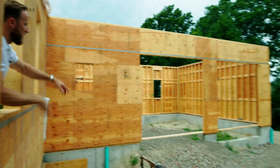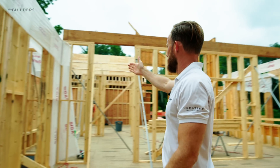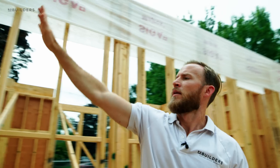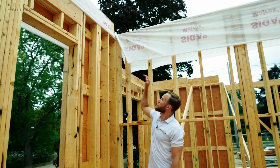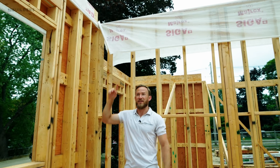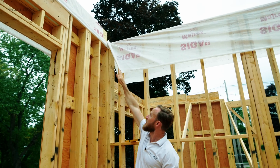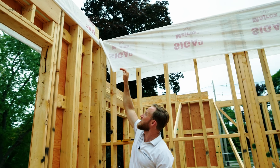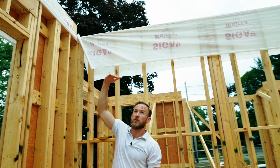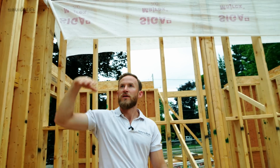This will go out to our parking court — you can see our two car garage over there and our single car garage there. Going back to the Majrex — similar to the walls — you can see that detail is there. Mike is also putting it over the top plate. You can see here where it goes from the interior wall, up and wrapping across the top plate and then on the rim joist of the floor system. This allows us to insulate this wall cavity, go up, tie into that piece of Majrex, and then it continues up all the way to the next wall. He'll flap that back over top the second floor system and then up the second floor wall — giving you that continuous barrier all the way up from this wall to the next.